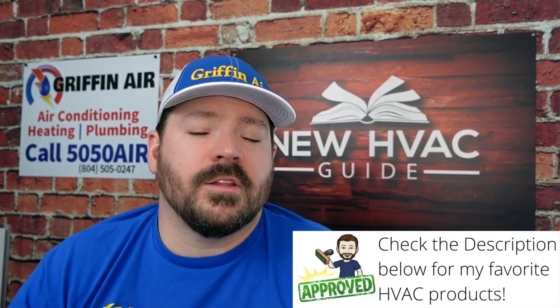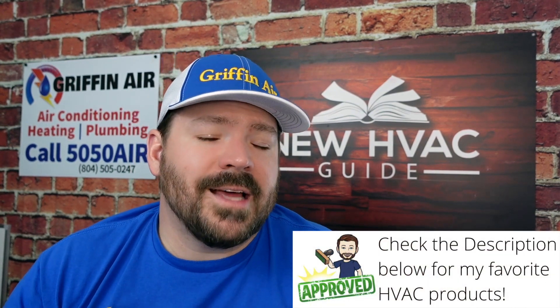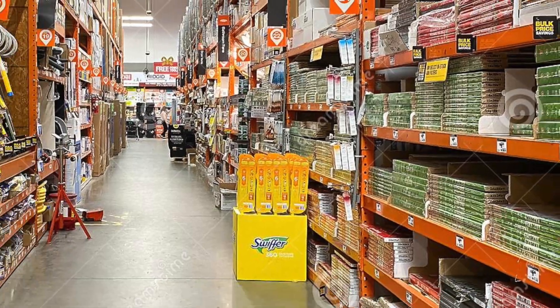Let's talk about thermostat options. If you go with the Daikin Fit, you have to use a proprietary thermostat — either the Daikin One Plus or the Daikin One Touch. The reason is the communicating technology allows the thermostat to talk to the outdoor unit, so on a mild day it knows not to ramp up and draw extra energy. In contrast, the GreeFlex is non-communicating — it still ramps up and down by monitoring coil temperature or pressures from the evaporator coil, but you could purchase a thermostat from a hardware store. You just wouldn't have that communicating technology.